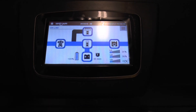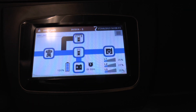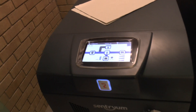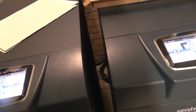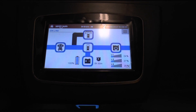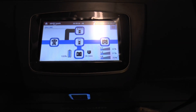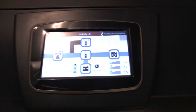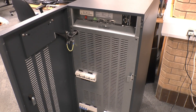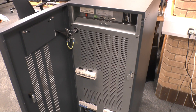These are 30kVA units, a drop in size from the 40kVA ones taken out, but those in turn would double the size of the units they replaced. It shows how server room requirements have changed over time as server requirements have increased and decreased again as more services get pushed out to the cloud onto someone else's computer and someone else's UPS. The UPS is estimated at 50 minutes of run time on the present load, but even 30 seconds would be enough as there's a big generator on site as well. That means we've got two 40kVA UPSs to dismantle.